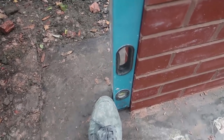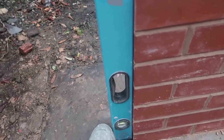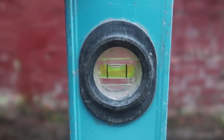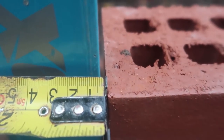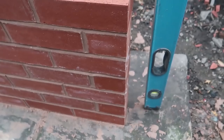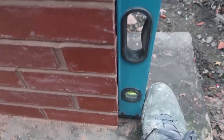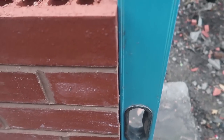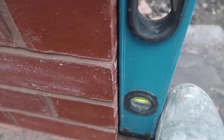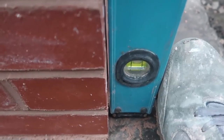So our level on top shows eight millimeters out. Now we'll do the reveals. Not too bad — touching the level on the face, not too bad for touching but there we go. Putting it plumb, it's about three mil out on this reveal. Now the other reveal — again not bad for touching. We've shoved it over a bit so the bottom is out; it's plumb and then about three mil out there — perhaps even less.